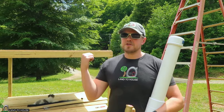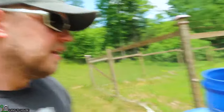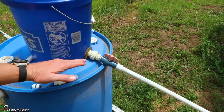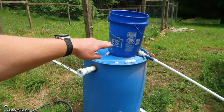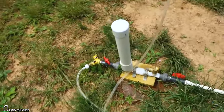Now let's head over to my little setup and I'll show you how to operate the pump. You need a water source — in my example, I'm just using a bucket with water in it, but you're going to want to use the ram pump in a creek or small river. You'll need a drive pipe, which carries the water to the pump. This has to have head pressure, which is drop in elevation. My bucket is up and it has a three-foot drop that goes down to the pump.